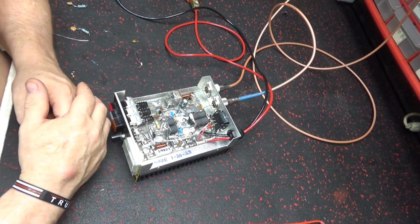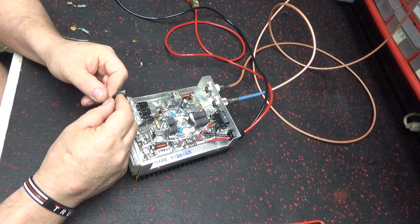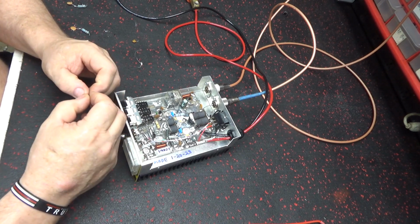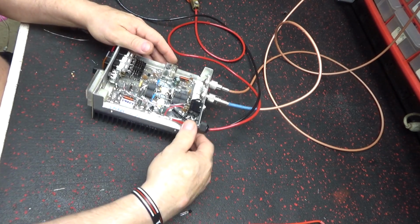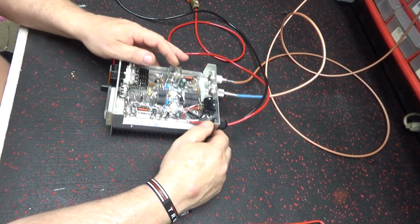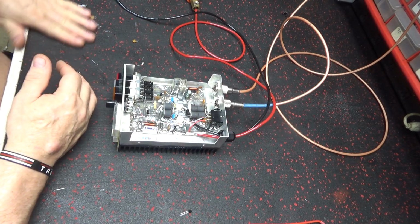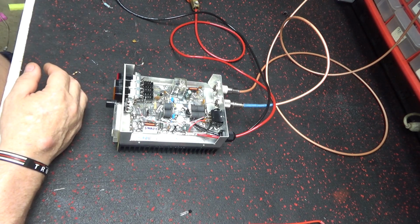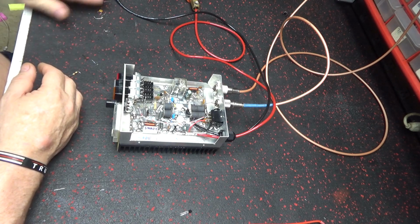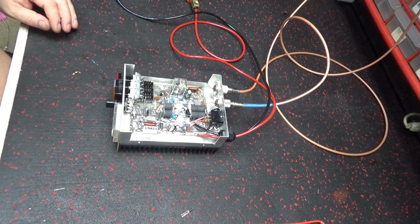Well, lo and behold, I changed the key-up circuit. It was a 4403 in it. I changed the key-up circuit to what a Texas Star normally runs, a 2907A. And lo and behold, she's up back and working. So, another point to the wisdom of Gatekeeper.